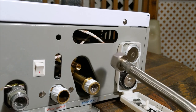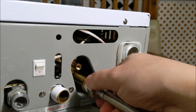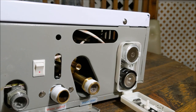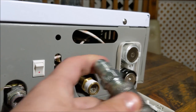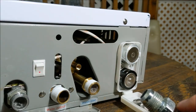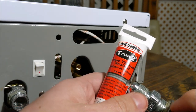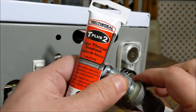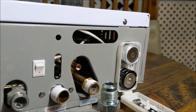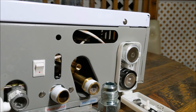Your half-inch braided flex pipe will go in there as well — I'm not going to push it all the way through because we're going to mount it first. Now, I ran out of the first thread sealant, so this is a different bottle — the colors are different but it works the same. You can see it's in there real good, which means it's going to be a tight seal. When you apply it, get it all over the thread; don't worry if you put too much, just make sure you get it all the way around.